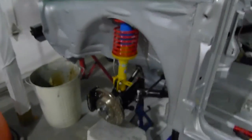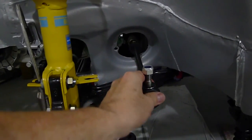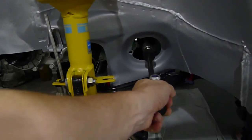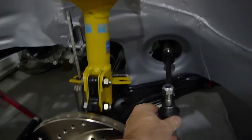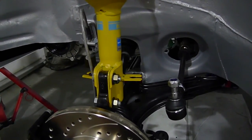Got the front end all done, steering's nice and smooth now. I had to actually back off the rack — it moves smoothly now end to end. There's the wheel spinning as I pull this back and forth, so I had to back off on the tension on the pinion pressure. I had it up a little bit tight and it was binding towards the ends of movement.